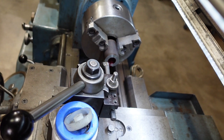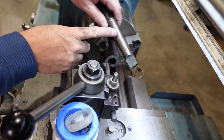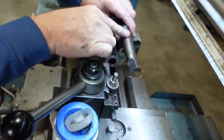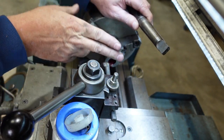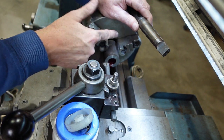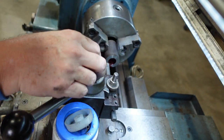I'm at that point where I have to admit that there are sometimes no really good choices, but just a collection of equally bad choices. When I set this taper up, I used this drill bit, and I was cutting a taper like this, so the tool is going away. Now I want to use the same setting, and the setting worked really well. I want to use the same setting for these adapters, which means of course the small end of the taper is going to be down here and the big end is there.